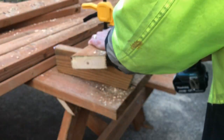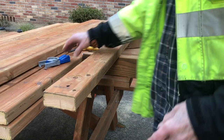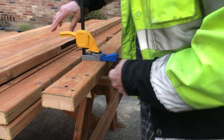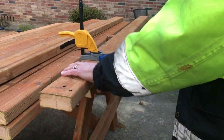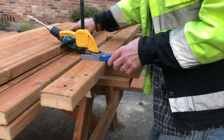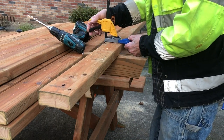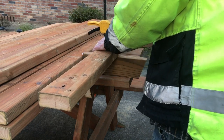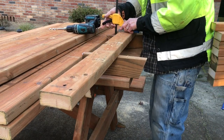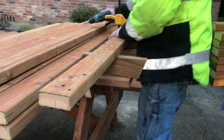These are our battens and I'm drilling two holes on each batten, on either side of the lines. Be sure you drill them the right direction — you want the screw to go up into the table, so the longer angle goes toward the tabletop. For the seat braces, these get one pocket hole per mark. The jig has two holes — just pick one and stay on the same one so the distance is always the same.